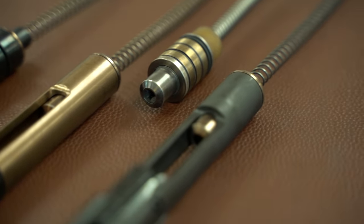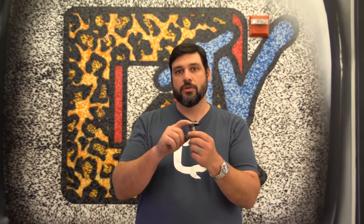What we settled on, however, also includes a bumper, and the bumper does another thing — this is a hollow bolt carrier, not just in this cylinder section but also up in the middle here. It is filled full of small-diameter tungsten balls — the heaviest, basically tiny little birdshot we could find — with a more traditional but slightly shorter bumper inserted in the back like your traditional buffer. This is a specialty material; the balls are expensive.